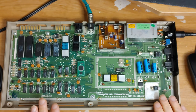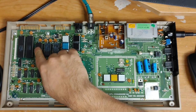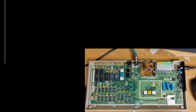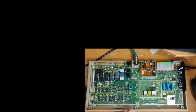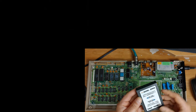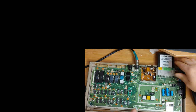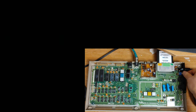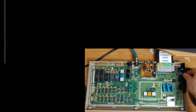I have my known working board here, power plugged in, hooked up to the TV. I've taken the basic ROM from the other computer and put it in here. Let's try it out. Well, that's certainly more than we were getting — I'm getting a garbled screen. Let's see what happens if I put in my Retro Rewind diagnostic cartridge. We're getting a black screen now.